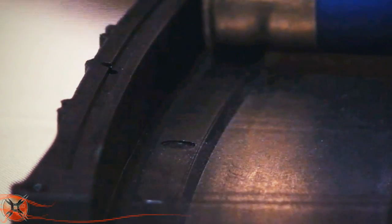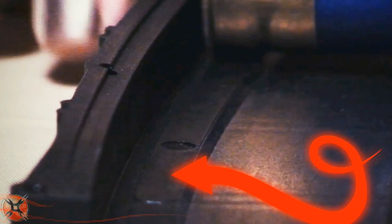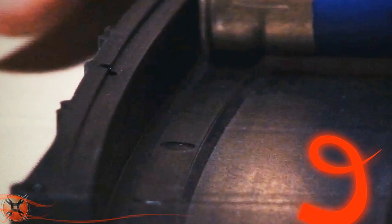The key to building a good mag is to make sure that the shells feed up smoothly inside of the mag body. This is how the shells ride in the magazine, with the rim of the shell in this groove. This raised rib here, where the high brass part of the shell rides, will be our focus today.